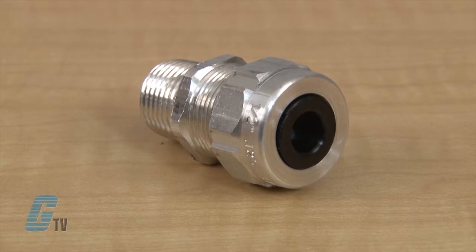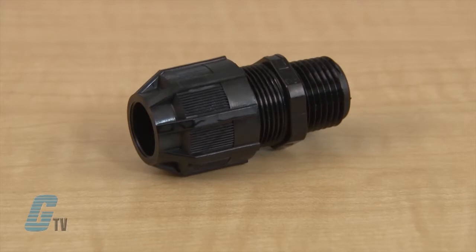The aluminum series of connectors offer the same benefits of the steel connectors but can accommodate a much larger variety of cord and cable types. The Ranger Series non-metallic liquid tight cord connector is made of a sturdy nylon material that adds corrosion resistance and is UL type 6 and 4X.